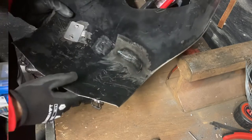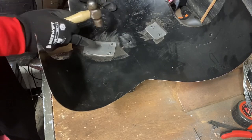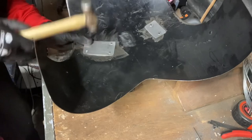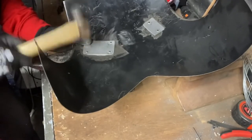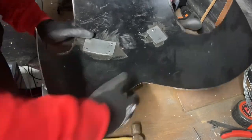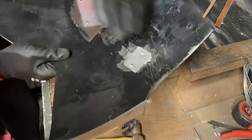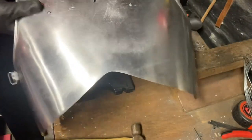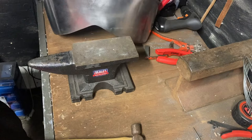We did that one previously and we've done the same with this plate — cut it, drilled it, drilled the back plate of the cuirass. I've done three rivets, this is the last one, and once this is done it will be fully repaired. There we have it — no wiggle in that plate or that one, so they're nice and strong. The shape conforms to the inside so it's not sticking out. On the other side all you can see is four nice old-looking rivets, so you wouldn't necessarily be any the wiser.